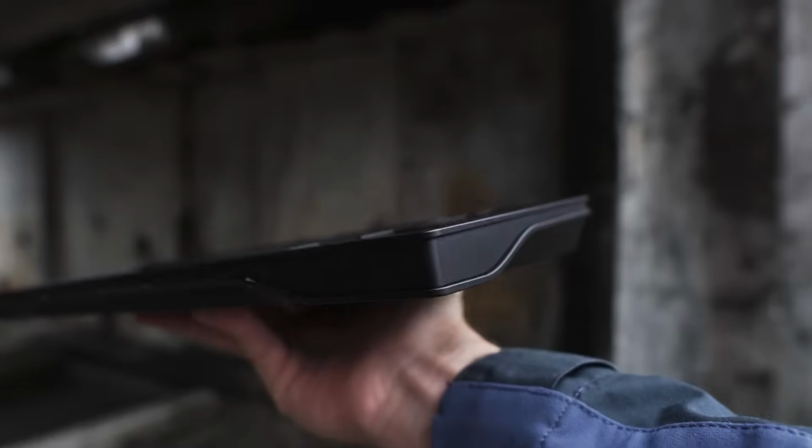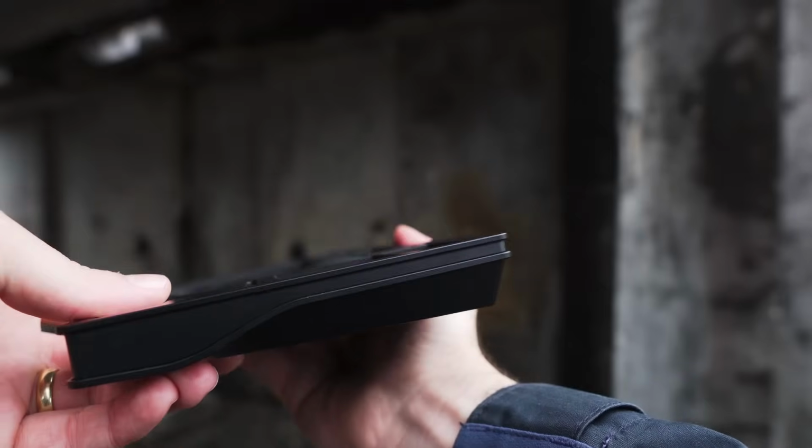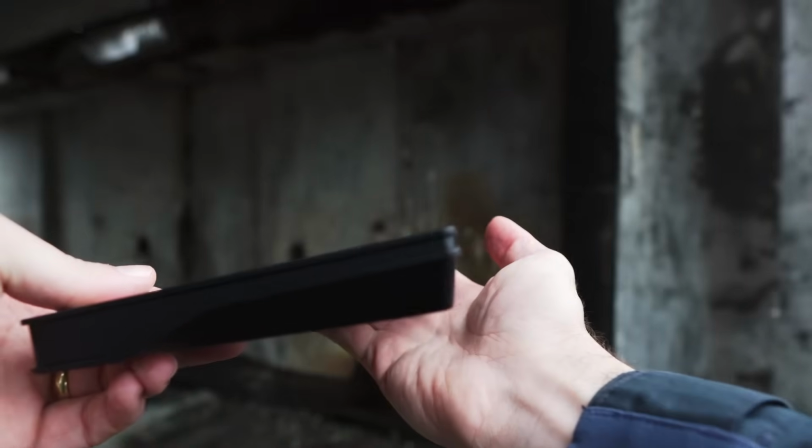Now, casting is basically the same as plastic injection, but using metal. And we've been looking at using zinc alloy metal, and zinc alloy is way heavier than aluminum. It is also way stronger than aluminum and has a kind of different feel. But the great thing about casting it is that we can do any design we really want to do, similar to doing a plastic case. So we have a zinc alloy case, which has the same design as the 80HE, but then it's heavy, like it's really heavy.